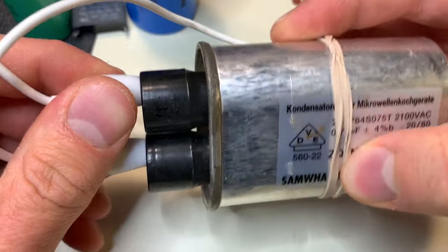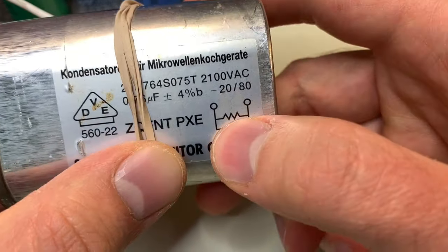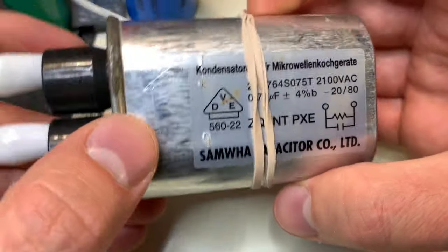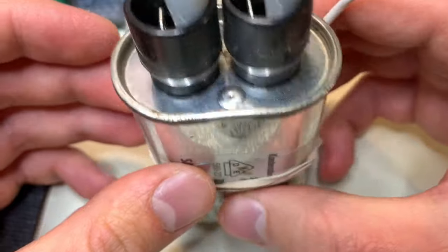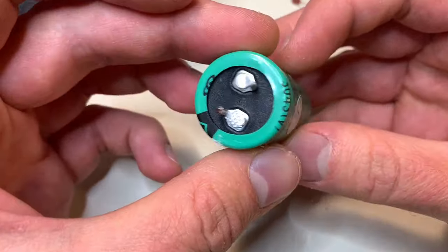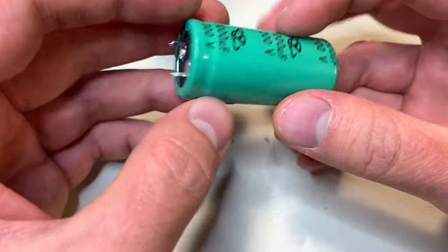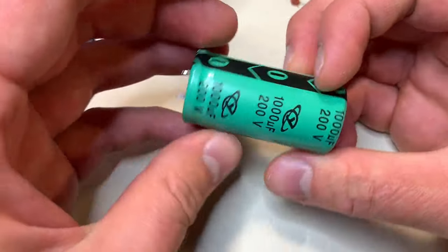The reason I have it shorted out, and generally the reason you want to keep these shorted out, is you never really want to rely on just one point of failure. So if that resistor fails for any reason, this capacitor could potentially store quite a large amount of power and you wouldn't be any the wiser. But while these capacitors have safety mechanisms built in, these ones don't. There's no resistor inside of here. So if you charge this capacitor up, it's going to maintain — it will have some leakage and start discharging slowly over time, but it will maintain a significant amount of charge even when disconnected from power.